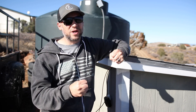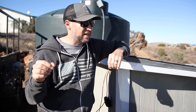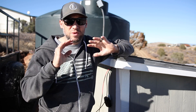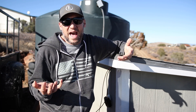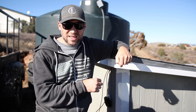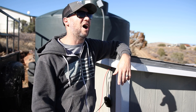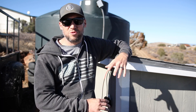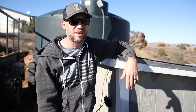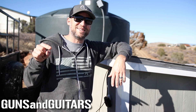I'm extremely impressed with that Golden Mate battery. Calculating the pump's draw and logging our water usage, it really shouldn't have lasted more than about two hours of total pumping — yet we went three days of normal use: laundry, dishes, showers, without holding back. The math doesn't quite add up, so my pump probably isn't drawing quite the wattage I expected. But I can attest that if it were less than 100 amp-hours it would not have lasted that long. The sun is shining now, we've been off-grid the last few days and it's working great. I'm glad we got the rainstorm because it gave real perspective — what happens when the sun doesn't come out for five days. Let me know in the comments what you think of this project, and we'll get back to some guitar building real soon. I'm Dan, this is Guns and Guitars — see you in the next video.